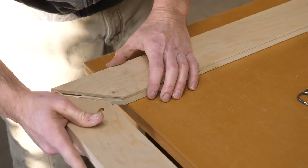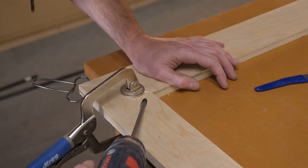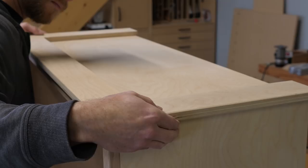Similar to my lunch, this cabinet is being built from leftovers. I didn't have a piece of plywood large enough for a solid bottom, so I made a little base molding type of thingy. For a cabinet that will have casters attached, I think a double thickness bottom is important. After the miters were dry, I glued and nailed it in place.